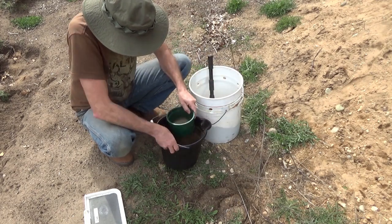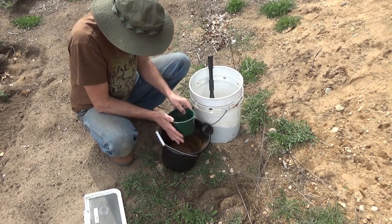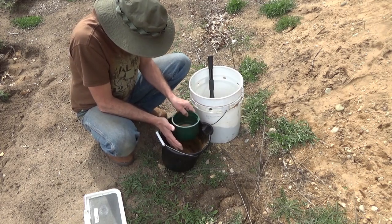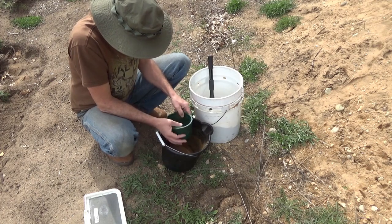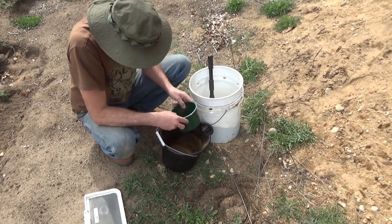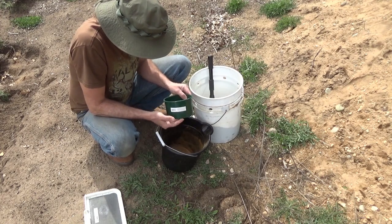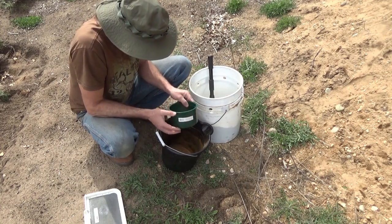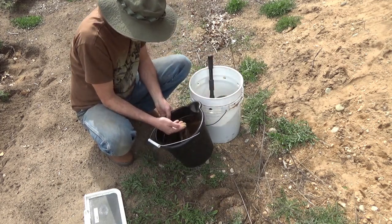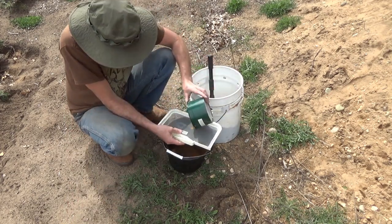It's going to take me some time — a lot of time — but I want to get out all the chunks and have super fine sand for my molds. That 50 mesh is going to reject a lot. I might do a couple of different batches and experiment, because it rejects almost everything. That is fine though — that is really fine. I think I'm going to use the dryer vent; it filters out the bigger grains. You can see the difference.